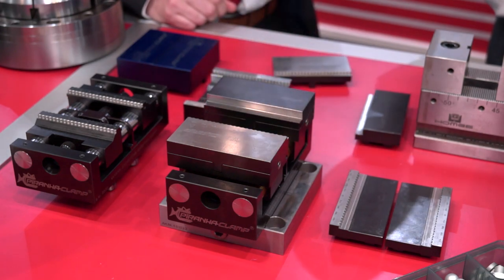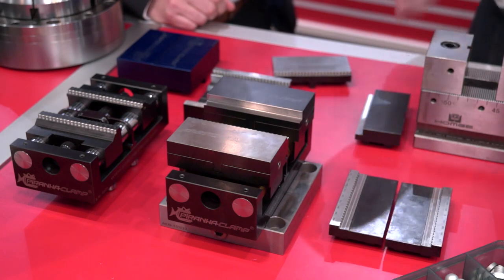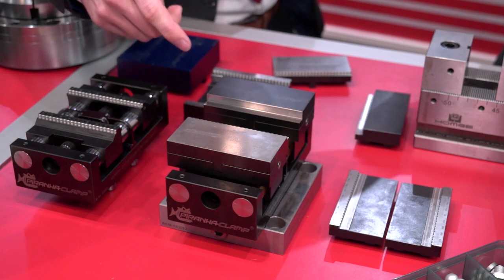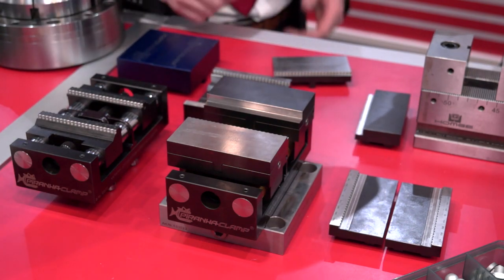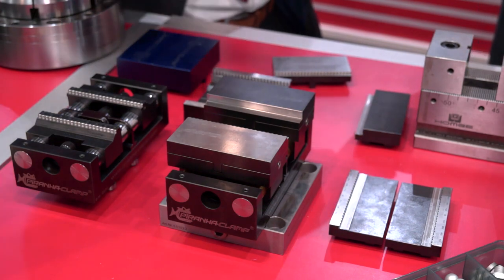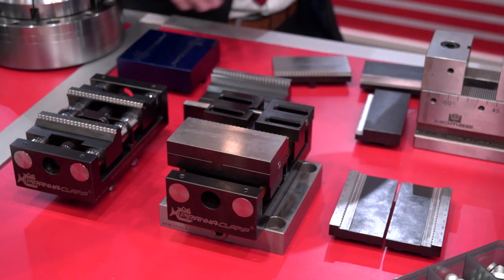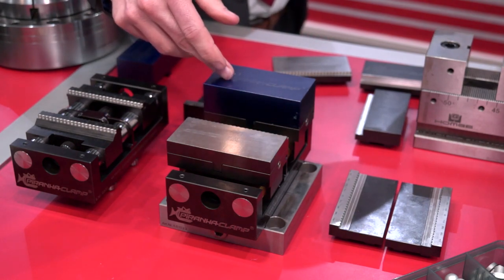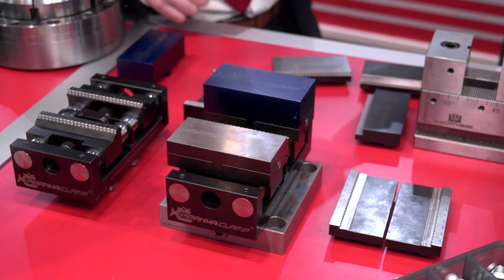You've got repeatability, accuracy — everything like that — and the same amount of power going through? No problem. We remilled the jaws at the end, put them together and remilled them to zero, so the accuracy is under 10 microns. It also works like another chuck — if you need a special geometry, you can put your own jaws on, mill your geometry, and you have accuracy also in five to ten microns.